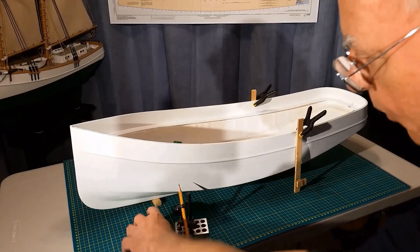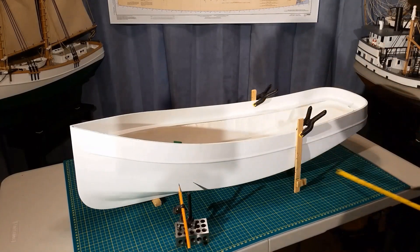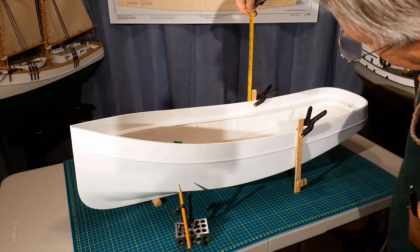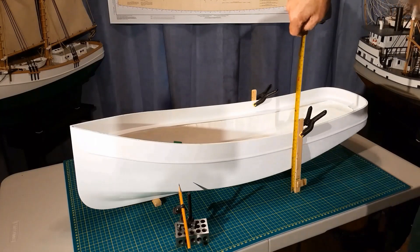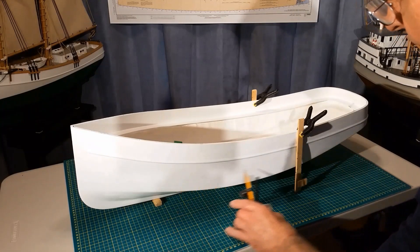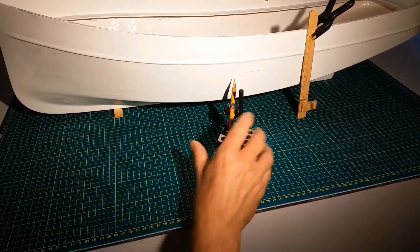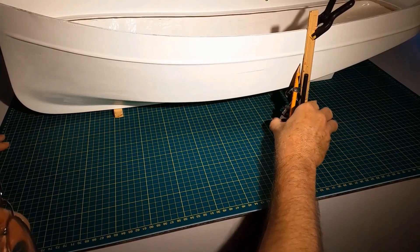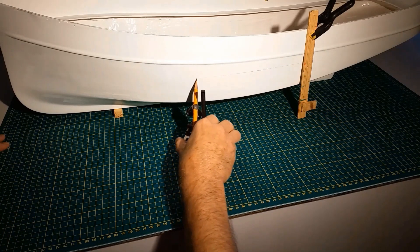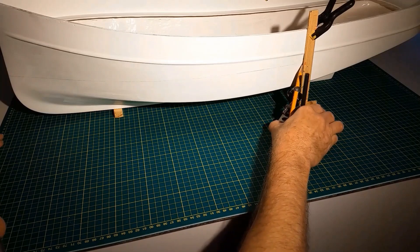The boat is set up on a one-half inch thick block eight inches back from the stem. The bottom of the keel at the keel shoe end is laying directly onto the grid — six and thirteen-sixteenths on each side. We will be able to mark the waterline by sliding this one-two-three block. We are set up on a surface that I know is very level. Just slide the pencil along the hull just like this. Don't press too hard. I like to come back and check in here to make sure it hasn't moved at all.